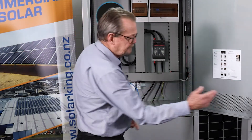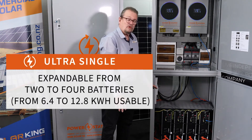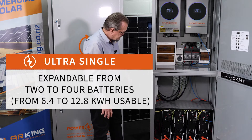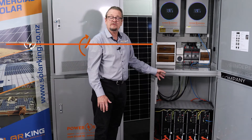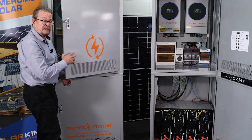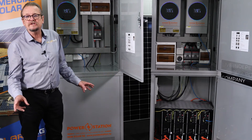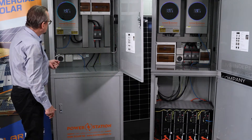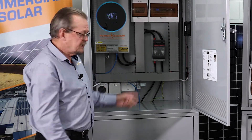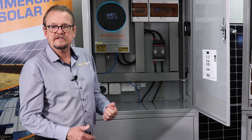Like its big brother, it's designed to have up to typically four batteries. In this system you would potentially have four, five, or maybe six batteries — up to eight. But as it only has 6 kilowatts of solar panels, we recommend starting with four batteries, which is 12 kilowatt hours of storage. So six kilowatts of solar, 5.6 kilowatts of AC feed, and typically 12 kilowatt hours of storage.